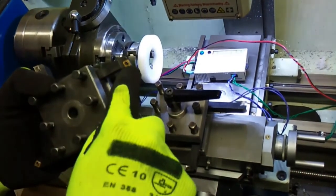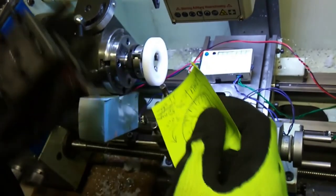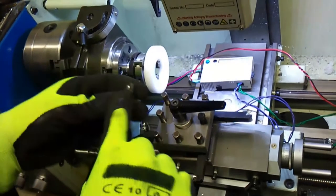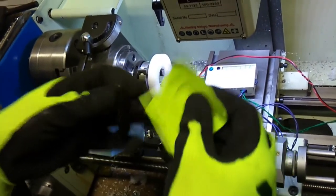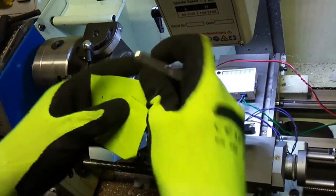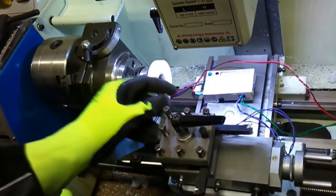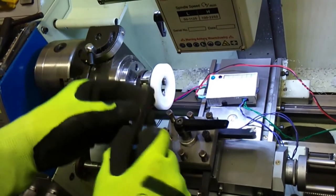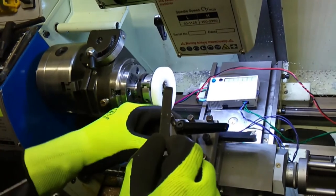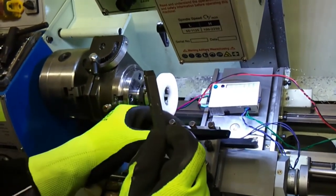This is the metal tool post with carbide tool tips, and they are not that very sharp so you see it won't cut into the material. But over here we have the plastic tool post with special tool tips like this one, and they can easily cut into your fingers. I will demonstrate it with a piece of paper — it will cut through paper easily, and easily within the plastic. So we take this tool bit that was originally put in like this, but we want to cut in this way without rotating the head, so we turn the tool post and put some spacers underneath it and then tighten the cutter.